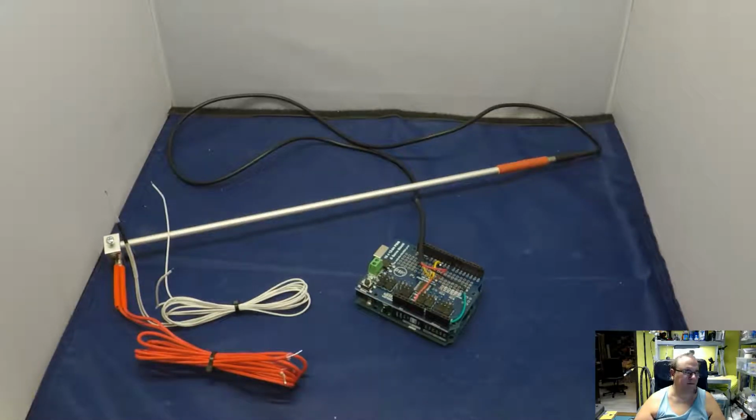Yeah, and then I did some heating tests with this. So, running the heater block at around 8 watts, it got around 60 Celsius, but still did not migrate the temperature. The heat transfer wasn't enough to heat up the other end. And then I thought that if it's going to get that hot, then I want to put it in some kind of protected enclosure, so that one doesn't burn oneself when using this testing equipment. So I'm actually thinking of putting it in a box. It'll also protect it from drafts and stuff in the environment, and make for more stable measurements.